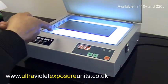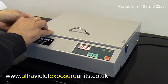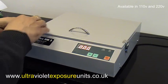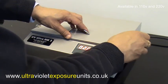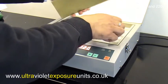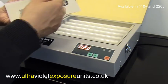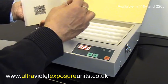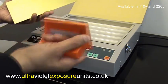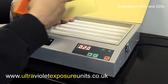Obviously you're not supposed to look at UV light, but briefly I'm just going to show you what's happening. Can you see the UV light? That's now exposing the artwork to the printing plate. Once we get to zero it'll automatically cut out and the UV light will go off. The lamps are now off. If you expose for a sufficient time you can normally see a kind of image or imprint on the plates, and then as I said you put the plate under warm water and scrub it in a circular motion and your design will wash out.